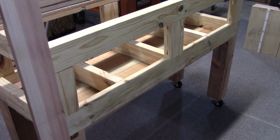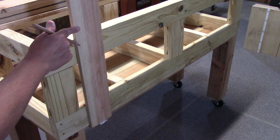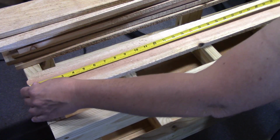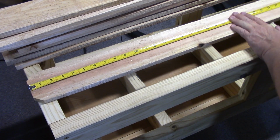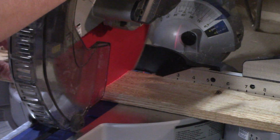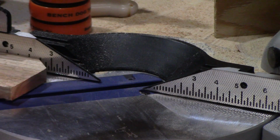I wanted this planter bed to mimic the same look as the privacy fence in our backyard, but you could finish it with other materials and in a completely different arrangement than the one I chose. Using 4-foot fence pickets, I cut them into 3 equal lengths of 16 inches. After cutting each to length, I then cut 45-degree dog-ear notches on one end of each board.